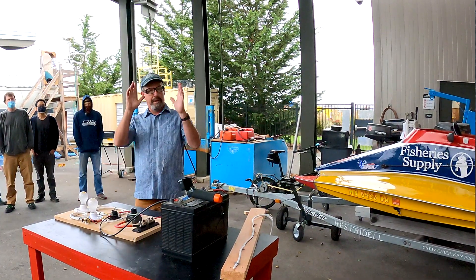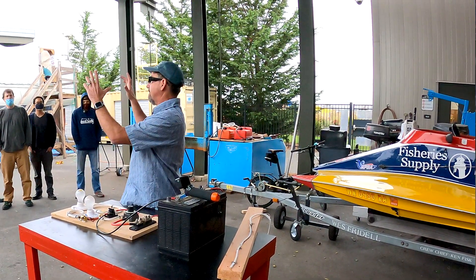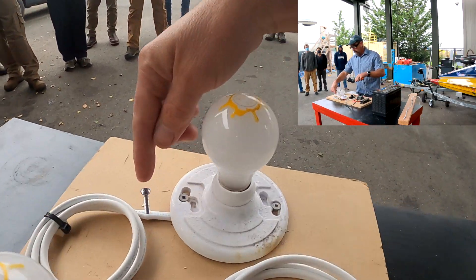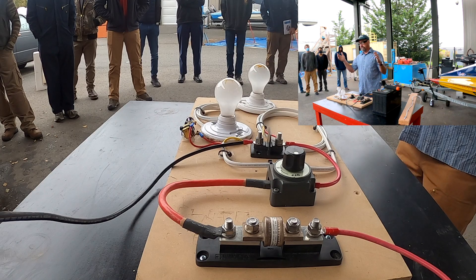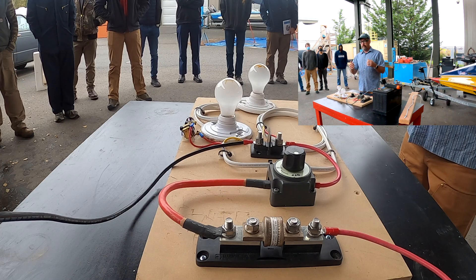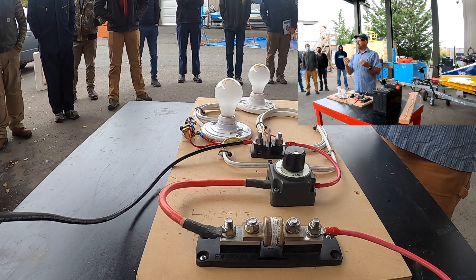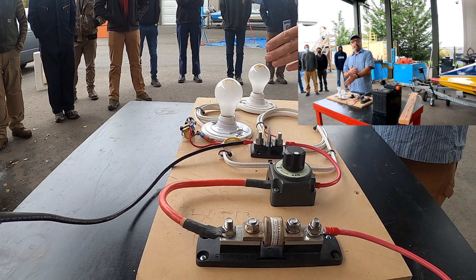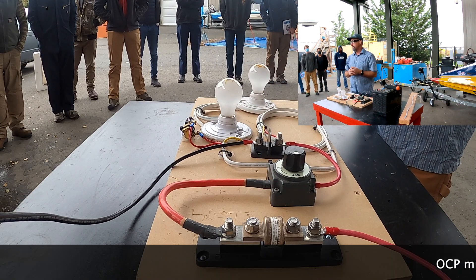It's a new boat to me, so I've bought a new picture that I'm going to hang on the wall right above the bunk. Inadvertently, when I mount it on the wall, I run a sheetrock screw or fastener right through into the conductor — that's a short circuit. Now, behind the scenes, you're in your pajamas going to turn on the light to read your favorite novel. There's a big fuse for the anchor winch, but when the previous owner installed the reading light with much smaller gauge wire, they never put in the proper OCP.